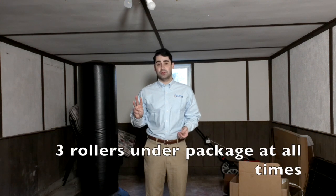A few tips to keep in mind about conveyors. The package you are conveying should be sized smaller than the between-frame size — this limits packages getting stuck. Also, it is important to be aware there must be three rollers under the package at all times. If you don't follow this rule, your item can get trapped in the conveyor.